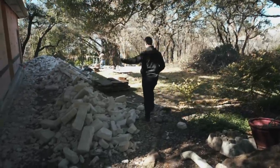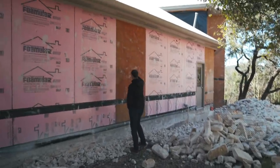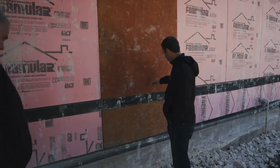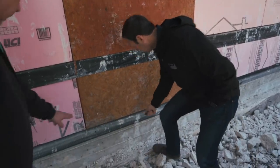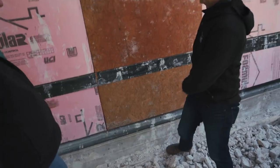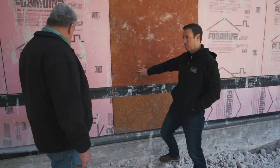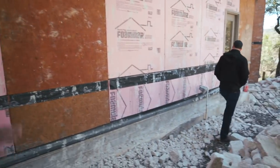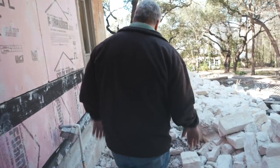As we come around the corner, in this big wall section on the backside of the garage, they've got one shear panel of OSB, a two-foot overhang, a gutter beyond that - and this part is in great shape. There's no rot, it's flaking a little bit, and over time this is disintegrating and not as strong as the day it was installed, but it's not rotted. The brick lug is dropped down another six or eight inches here, so this flashing hasn't been sitting in water for the last 20 years. Also, I'm not seeing any sprinkler heads pointing towards the building - if sprinklers were hitting this, this would be a very different scenario. The site also plays a role - we're literally walking downhill, so water that came down here is moving away from the house.